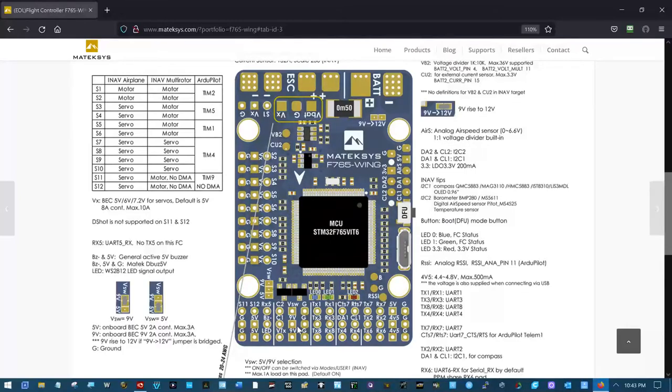But it's better to get a load on something and then measure the voltage across it than it is frequently to measure the voltage straight. You can get in trouble that way. And you can get in trouble by what scale you use on your meter. So I'm not teaching anybody how to use a meter. I'm just telling you, even I am.